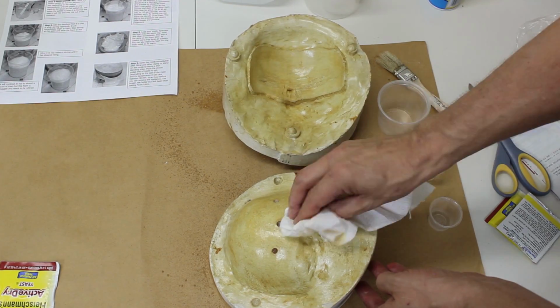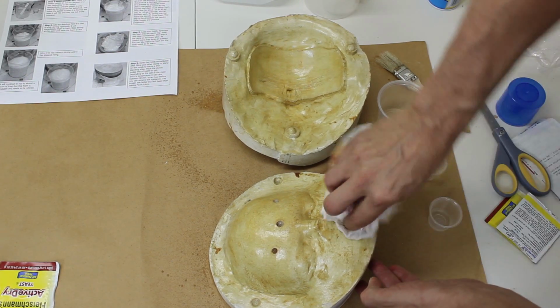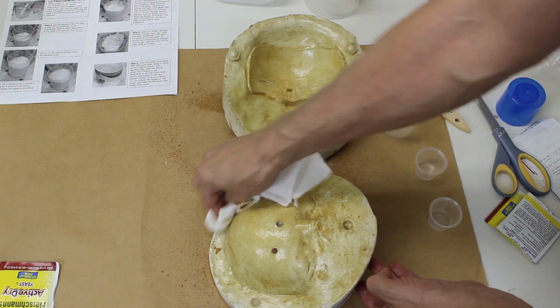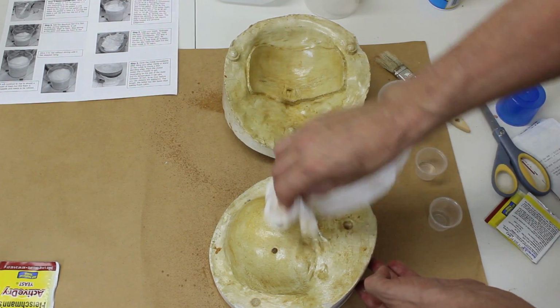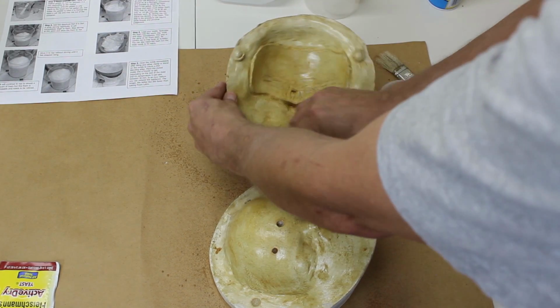Once you're finished releasing your mold halves, arrange the mold so that you can easily close it once it's filled. You may need to place blocks under the negative if it does not sit level. This is so the foam doesn't run out before you close it.